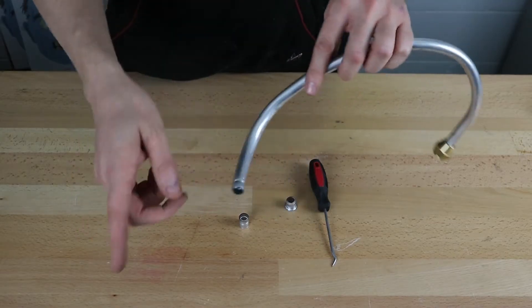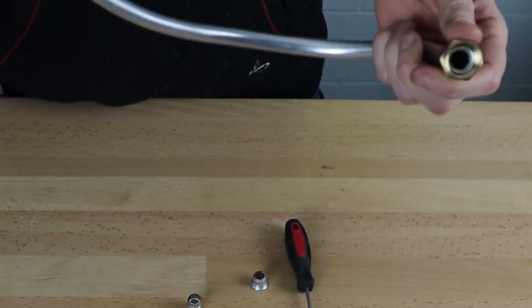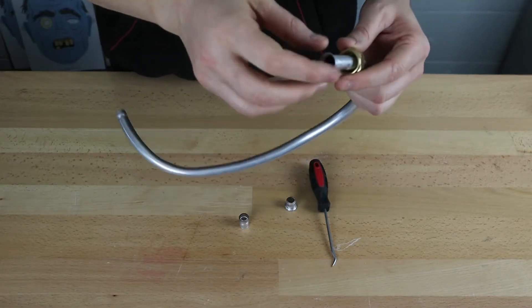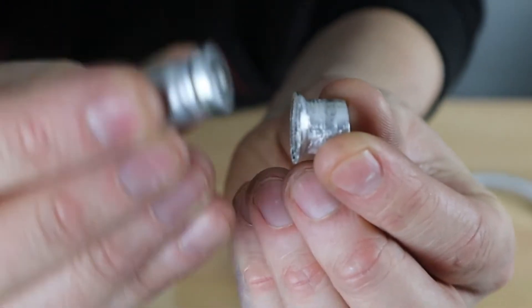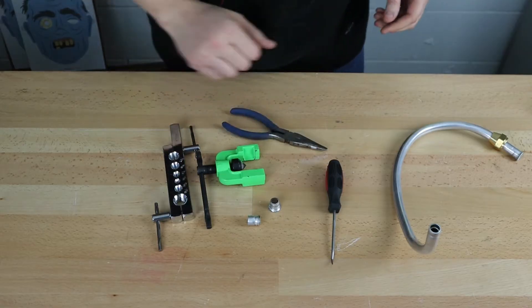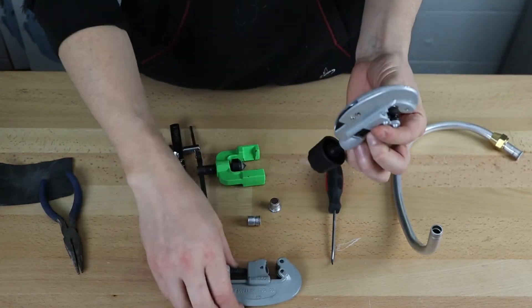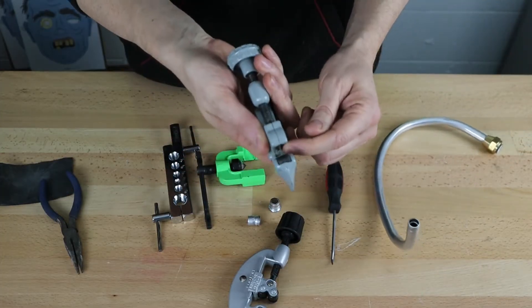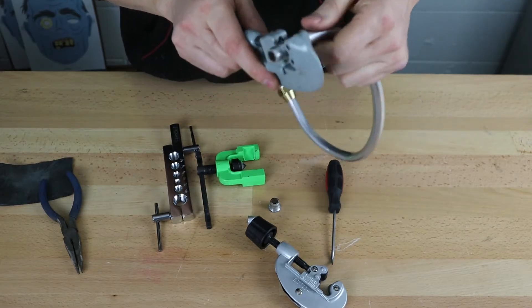For this air compressor, one of the biggest keys is a roll groover — or groove roller depending on the manufacturer — which creates a little groove in your tube where two of the compressions go on. This flare goes out to your radiator, the radiator has a flare going out to the self-draining water trap, the water trap has a flare attached to it, and then it goes back into the air compressor with that groove. So you really just need to focus on two things: your roll groover and your flare. For the flare I'm using a cheapo flaring tool and a pair of needle nose pliers to actually start the flare, plus the homemade roll groover — which you can repurpose from a pipe cutter by putting a washer in there.